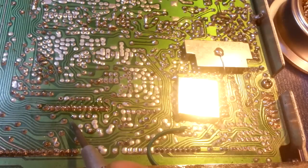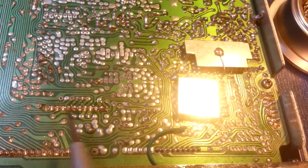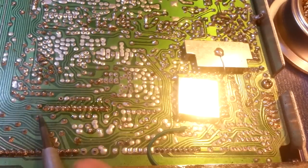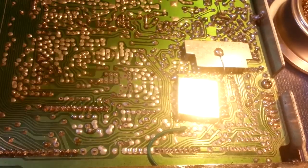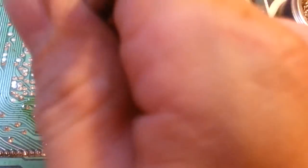The soldering temperature and the breakdown point of epoxy are right around the same temperature. If your dwell time on a solder joint is too long, you stand a really good chance of damaging or lifting traces. Good soldering practice — don't dwell on it too long. If you have a non-adjustable iron you're stuck at the factory temperature, but if you have an adjustable one you can play around and find what works.